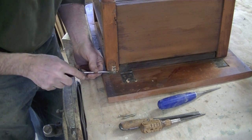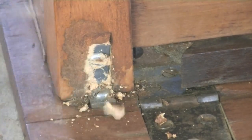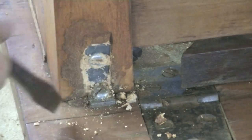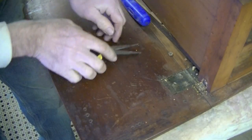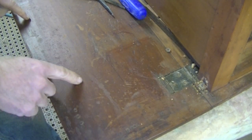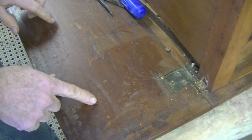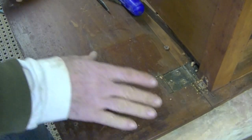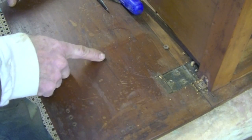Here's a good one. Someone has cut into the leg and maybe installed some kind of angle bracket, screwed it to the top, and then puttied over the angle bracket. On this side, on the underside of the leaf, you can see some reddish, maybe some sort of base stain, some darker finish underneath. This reddish stain is probably the original finish of the table, and even though I'm going to refinish the top, it's important to preserve the underside of this leaf because this is the evidence of what the original finish was like.